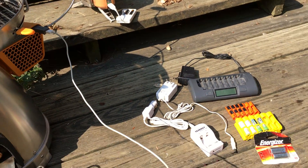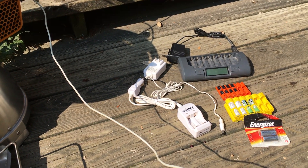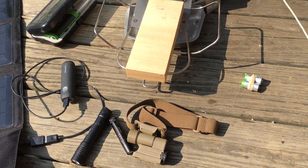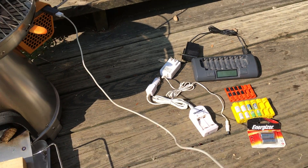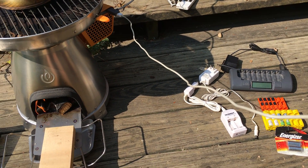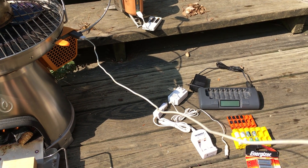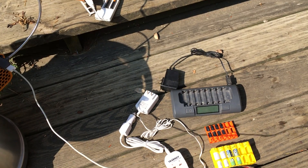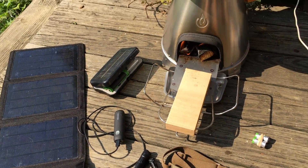Both solar and wood can be found on site very easily. And to back all of this up, there's also a generator source and large solar panel source as well. So this is a very micro power production system, but it's crucial because water and light are really what you need the most. The only other crucial needs potentially are communications — like powering a radio. I have a UHF weather radio, two different ones — one runs on its own solar panel and can take these batteries, and one can be plugged into the grid and also has a backup battery. So I can get information about the outside world. And then with the deep cycle batteries, I can easily run a modem — for us, the DSL is almost always up when the grid's down. So that's really all there is to very basic backup power.